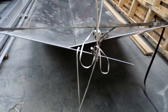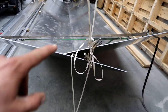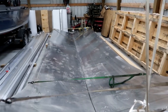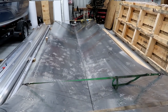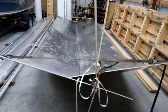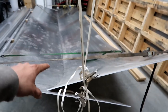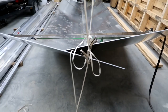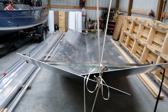Now I've got the boat mocked up. I've got about a 25-degree dead rise here in the front — I'm gonna have to cut these sheets. I basically just wanted to get a length. Starting out with 25-foot sheets, I've lost almost a foot by bringing this boat up, so I'm going to build a trailer 24 feet long, plumb down from the front of the boat, and then I'll add the tongue. I wanted to mock this up and just have a look-see at it.